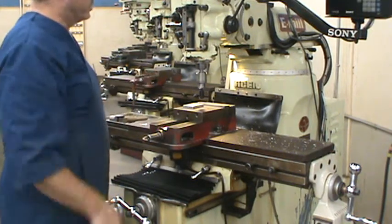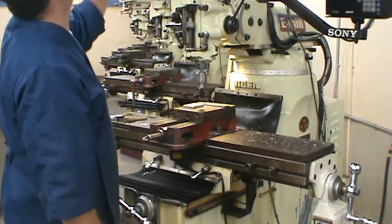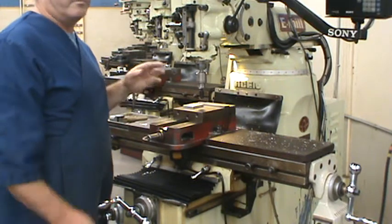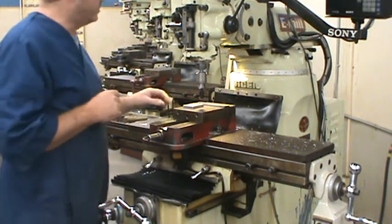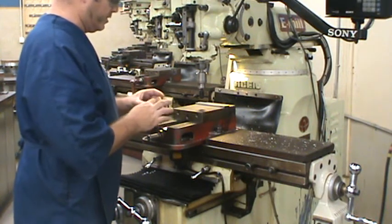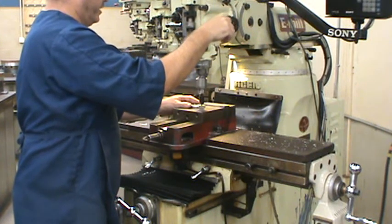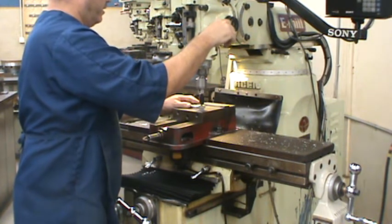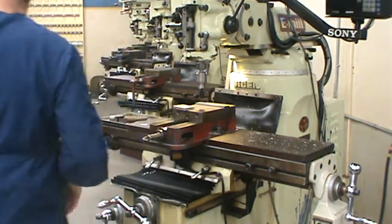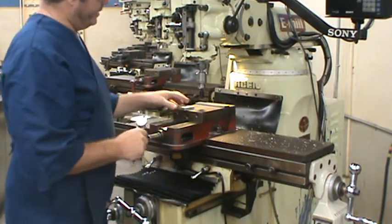I'm going to use a very slow RPM — I can actually get 200 or below. A six-flute countersink is going to be a little aggressive but it won't move the part around as much as single-flute countersinks do. I'm going to be real careful. I'll start with the smaller holes where I have good leverage, bring the spindle over the small hole, and just gently peck with a little bit of pressure.